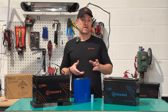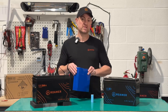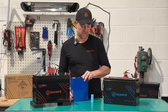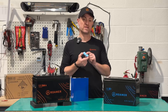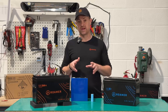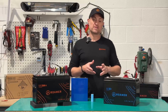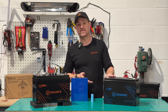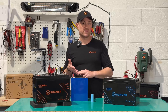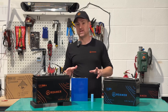I don't think the technology itself is bad — the idea of heating the cells is a good one. It's just the implementation that's bad. Trying to heat a cell this size from the outside is like trying to heat a frozen chicken in a frying pan — it's just not going to work. If you used smaller cells and could wrap each one individually, that would work a lot better. The slower the cell pack warms up, the more consistent the temperature, and the better that is for the long-term health and safety of the battery. The buildup of dendrites from lithium plating can cause short circuits and bigger problems, and I think this requires more testing before it's sold as a consumer product.